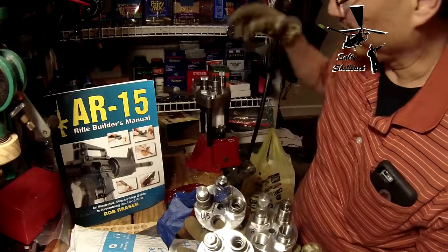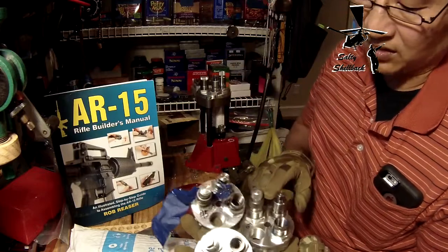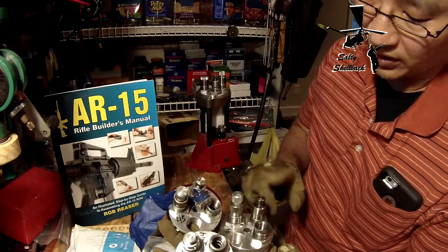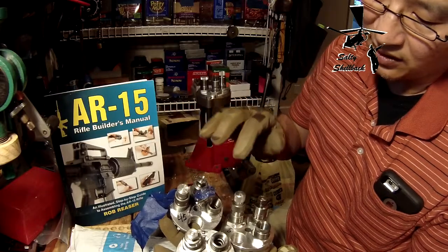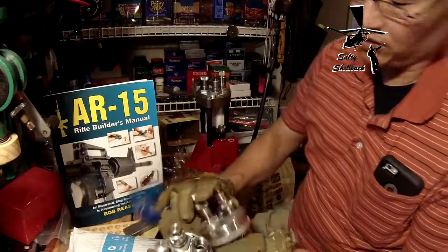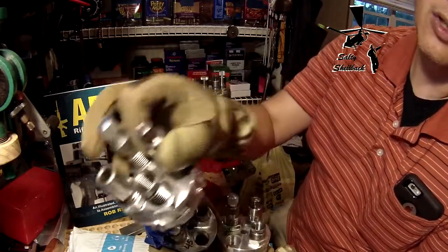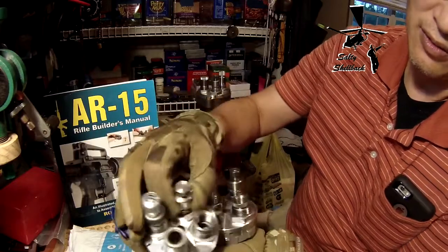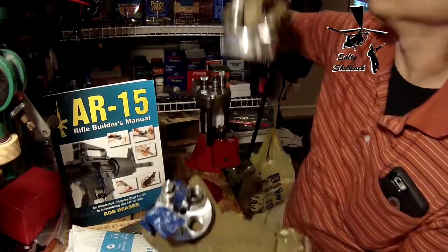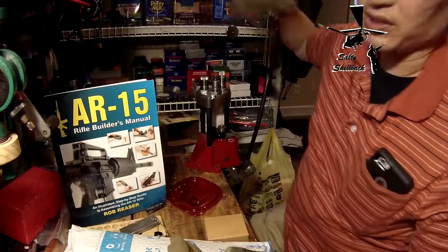It's nice that I can leave these set. With a single-stage press I would have to reset all the die spacings every time I wanted to change the die. But the 4-Turret Press really helps. I don't always use four dies — one is more for a factory crimp. But it is nice when I want to run a resizer. I can put the resizer die into the turret and run it in case I have a bullet that is oversized, without having to unload everything.